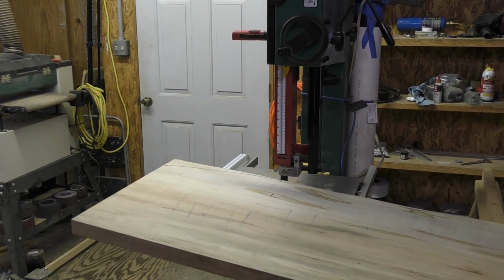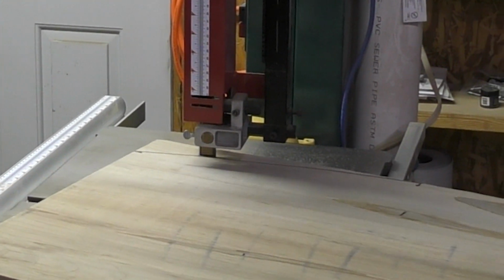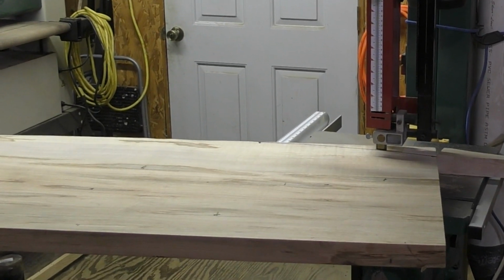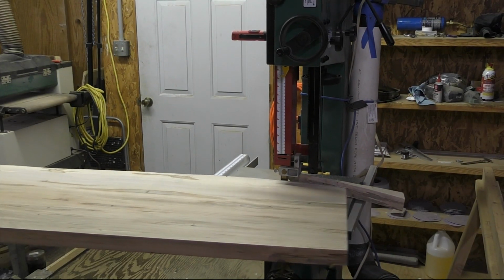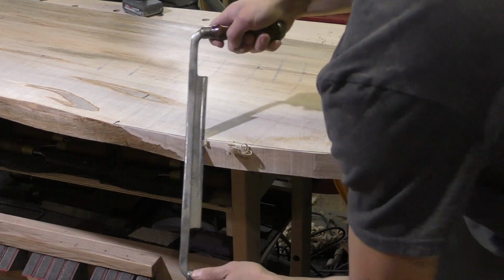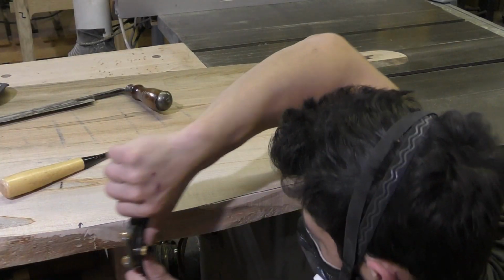After installing all the boxes, I turned my attention back to the top. So this is going to be butting against an extra wall, and we don't want it to stick out, but we want to have the depth of the big desk. So I kind of curved the live edge, that way it meshed into the wall, but you still get that extra depth in the center of the desk.